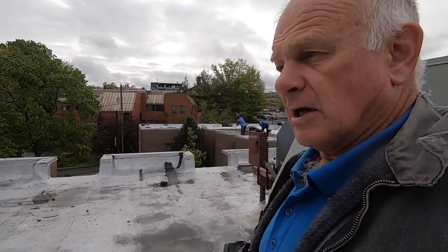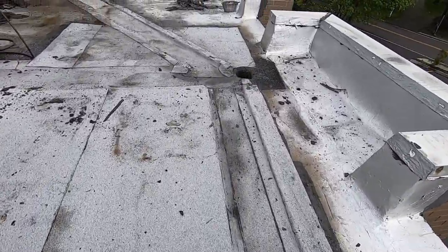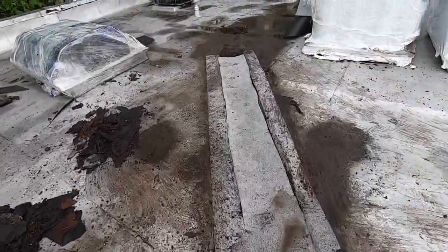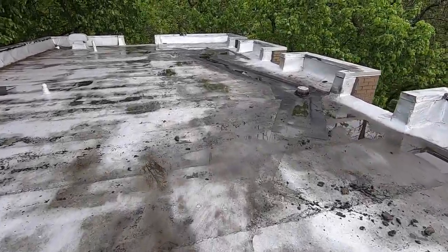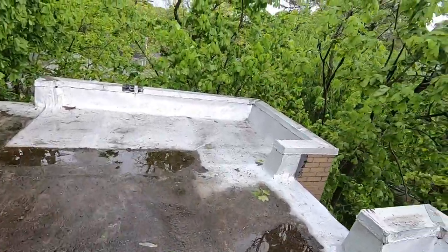So I started making water releases for the water ponding on this roof. There's almost no water sitting here now — it rained last night and I made a channel here. There's a channel on this area and I made the drain lower. You can see water can get through here — there's a channel down there and a channel down there to the ponding areas. This was ponding huge. There's another ponding area — big pond, water sitting here. So I've lowered the drain. There's about six roofs on here: old tar and gravel, then about four layers of torch down. Nobody ever took the time to make water flow and go up the walls.